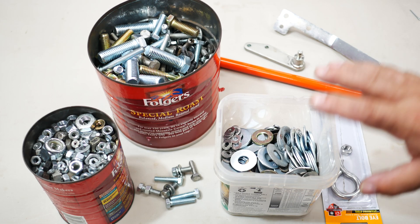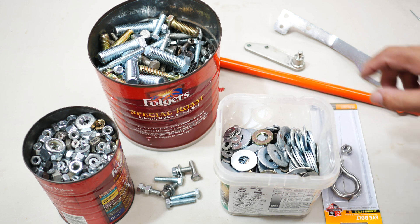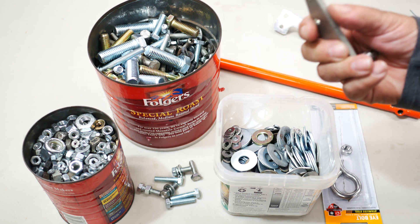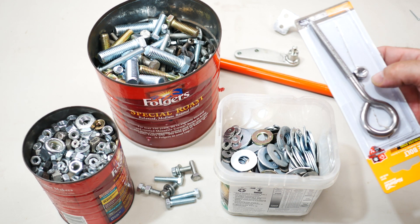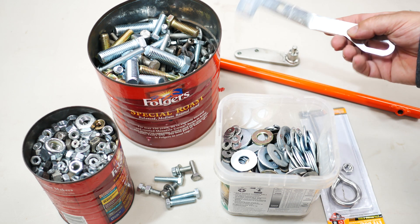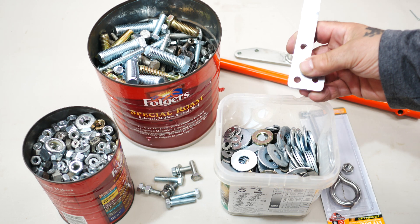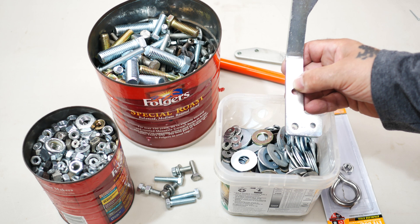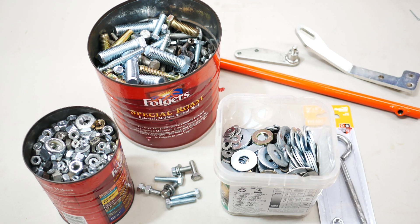So I went and pulled out all my buckets of stuff — I pretty much had everything, but I still ran down to the store to pick up a couple of things. I wanted to use hardened bolts instead of the cheap ones I had; they weren't very strong and I wanted something a little more rigid. I also picked up this stainless steel eyelet here, and I'm going to figure out a way to mount that to the arms of the loader. This is what I'm supposed to have on there if I had a newer BX — the guide rod would slide through this opening — but this is meant to bolt onto a flat spot that already exists on the new BX loader, and I don't have that flat spot.